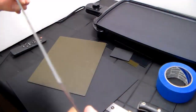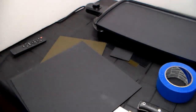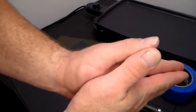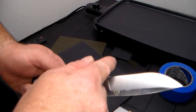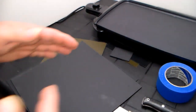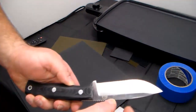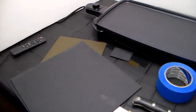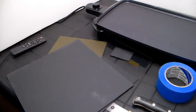I'm going to use black and the 0.060. When you're talking knife sheaths and kydex, there's really two styles. There is the taco style where you have one sheet and it folds around the blade, typically close to the spine coming just past the blade where your rivets would be. Then there is the pancake style where you have two separate pieces of kydex, put the blade in the middle and form around it, with a larger border and eyelets or rivets on both sides. I'm going to do a pancake style two-piece using the 0.060.